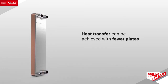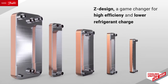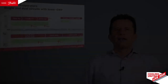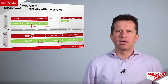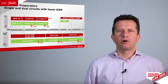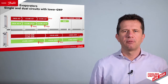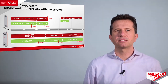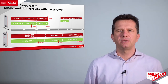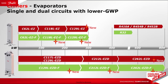The Z-Design really increases energy efficiency by using the microplate heat exchanger. Now, let's turn to what is new in the microplate heat exchanger. For chillers, we have released a new range optimized for high-density refrigerants — not only R410A, but also lower GWP replacements such as R32, R452B, and R454B. At the same time, we have expanded our range with new models.